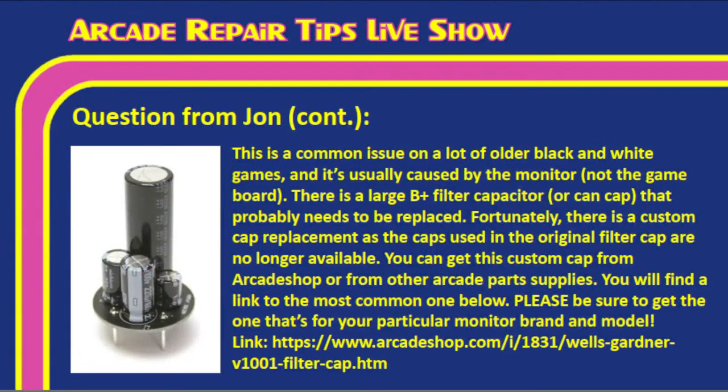Here, Tim. So this is a common issue with a lot of older black and white games, okay? And it's usually caused by the monitor, not the game board. We mentioned that. There's a large B-plus filter capacitor or can cap that probably needs to be replaced. Fortunately, there's a custom cap replacement, as the caps used in the original filter cap are no longer available. And you can get these custom caps from Arcade Shop or from other arcade part suppliers.